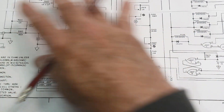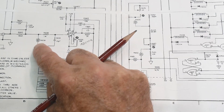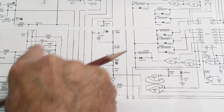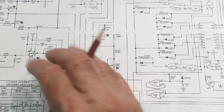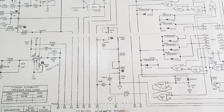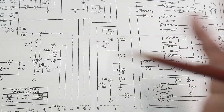The reason Keithley can make this and others can't is because they understand leakage. There are completely separated grounds: measurement ground, analog ground, digital ground, chassis ground — all separate. Everything is on Teflon standoffs, everything is point-to-point, so there is no leakage. These relays are very expensive, the resistors are probably expensive, and the capacitor must be really top quality. It's all about vigilance in physical design and diligent component selection.